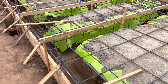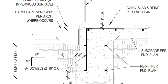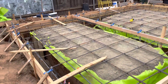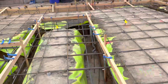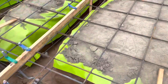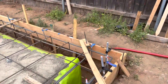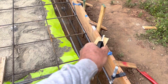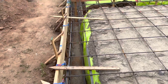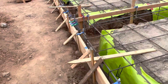The structural engineer on this called out number five rebar for the footings, top and bottom, and then a 16 by 16 grid with number four on the top with down bars and everything over 16 inches as well, so they're dropping down into the foundation. Over here we've got our ufer ground — it's coming up, and that's required by electrical code. You need at least 20 feet of at least half-inch rebar.